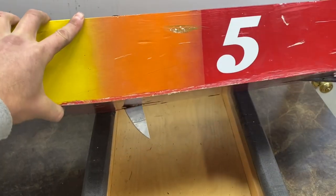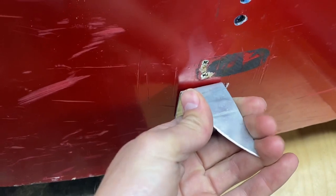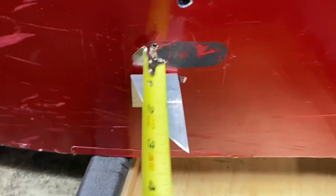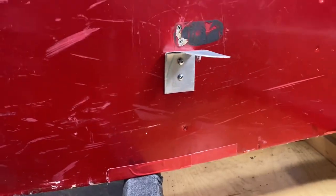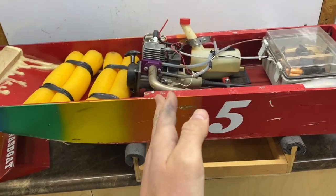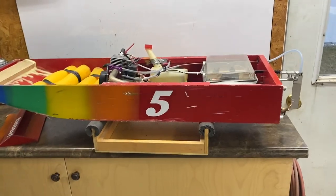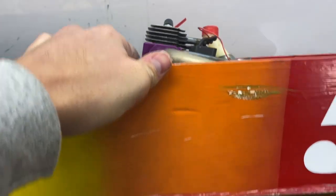Along with hardware, we need to talk about engine placement and a little bit of engineering on these boats. This is the shape of keel that I have found to work best — this size and shape. It's a little loose because, as you can tell, it gets a little rough out there, hence why we're starting over with a new hull. This keel is about three inches tall and an inch and a half wide, just screwed to the bottom, nice and sharp so it cuts through. You want your engine about in the center of the boat — it's all about finding that center of gravity. Being a straight shaft, you want the angle of that shaft to be as flat as possible so you get the most direct drive as the propeller pushes it forward. I've got my engine probably plenty far forward as far as weight goes, but I was trying to get my shaft flatter. Then when you put your keel in on the bottom, you want to put your keel right under the center of gravity — in my case, right under the engine.